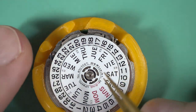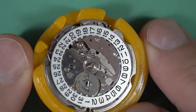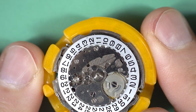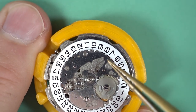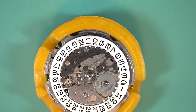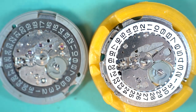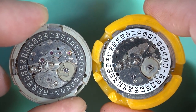Taking off the C ring — they've got a slightly different C ring which is a little bit more difficult to work with. You can see the calendar plate they've used is just the same one from the 6309, and it's even got holes there for the balance jewel which would normally sit there. If we grab a 6309 movement and look at the calendar side, you can actually see the similarities — the calendar wheel is in the same place.